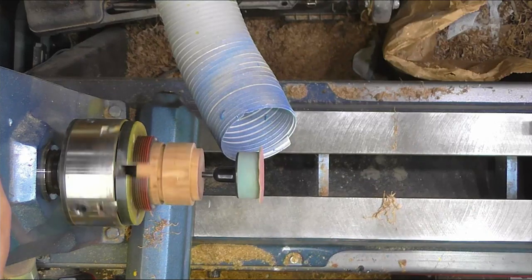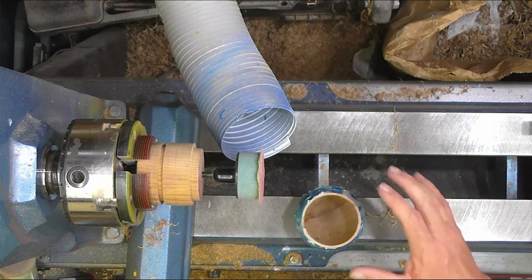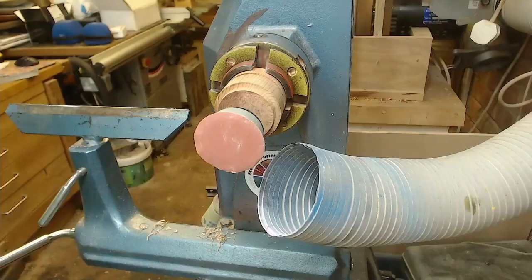So the bottom was sanded to 400 grit and there's my little project finished. Hope you like it. And there we have it — what a wonderful piece of kit. You still have to use judgment about how thin you're going to make your wall. You still have to guide the tool. You still have to work on the outside shape, because if it's a horrible shape on the outside, the inside isn't really going to matter at all. Now this may not have been the most ambitious first outing with the Simon Hope hollowing tool, but it's what I had readily available. I did need to finish this off, especially as all of you think it's a thing of great beauty. The real beauty though is that wonderful hollowing rig. Until next time, thanks for watching.